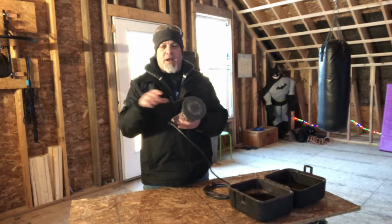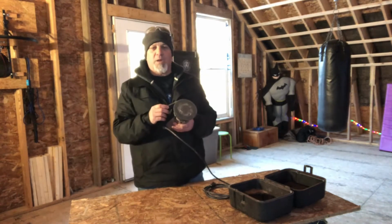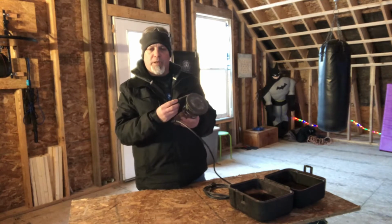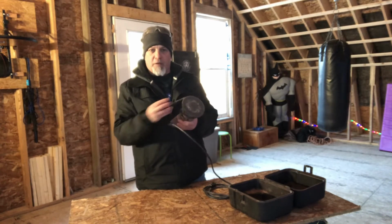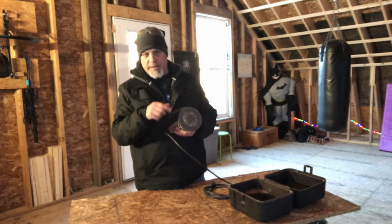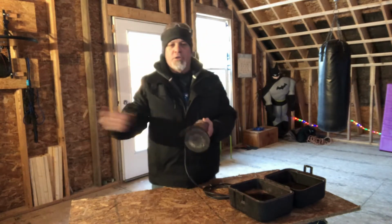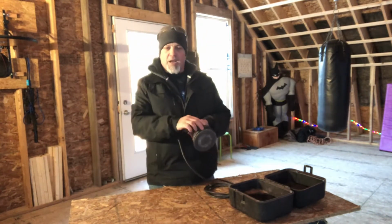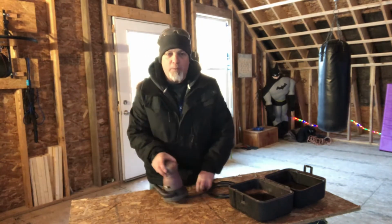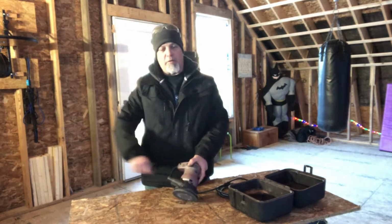Even wearing the mask, I recommend you go out and find a small attachment at Home Depot or Lowe's or one of those places. Go find a small attachment, a coupling or something, that you can take on and off. Honestly, I just take my shop vac, stick it on here with a small attachment, and tape it, because I take it on and off all the time. Put that thing on, turn your vacuum on, and start sanding. That will take all the sanding debris off your table or whatever. It'll suck it up inside and blow it out right here, right into your vacuum.